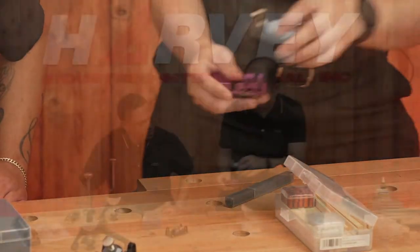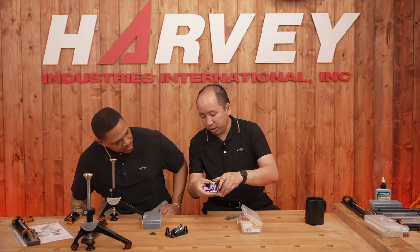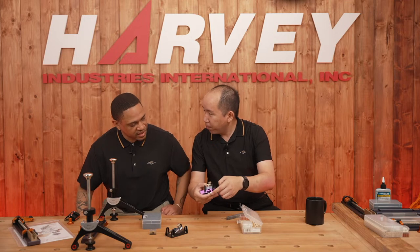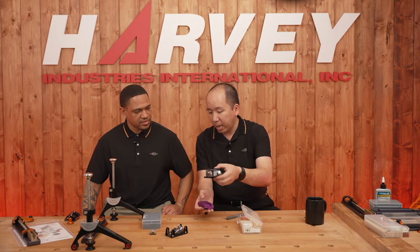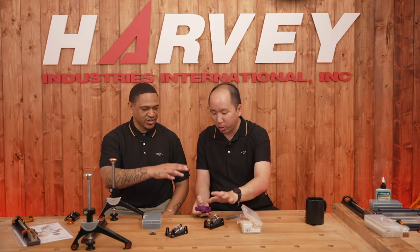If you loosen the screws and let them drop down, what you should see is that it sits like so onto the jig. Once you have it set up correctly, tighten these screws back up. And that's how you can set the correct height for your plane. So this obviously should be the first thing I do. That is definitely the very first thing you should do, before even trying to pull out the blanks.